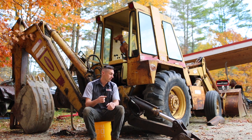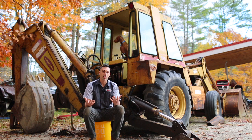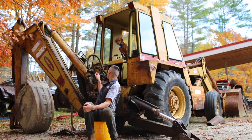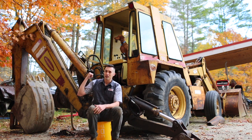In a recent video, I resealed this hydraulic cylinder for this stabilizer right here. And while that was successful, I found that the stabilizer arm would still fall down all on its own. It wouldn't stay upright. When it falls down, you can actually hear a leaking sound coming from the hydraulic control valve right here. And that tells me that I have some internal leaking.